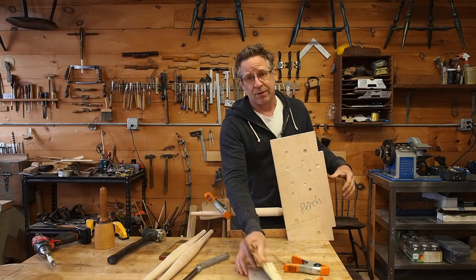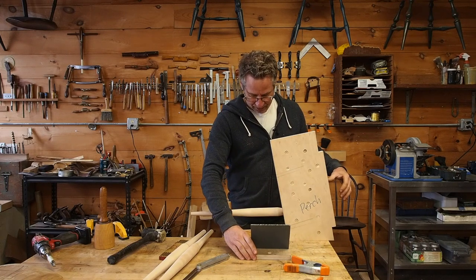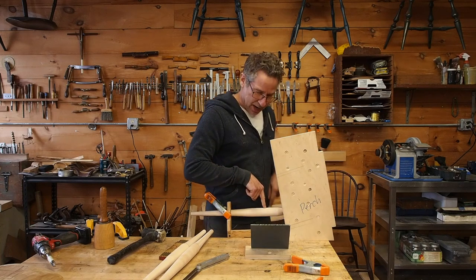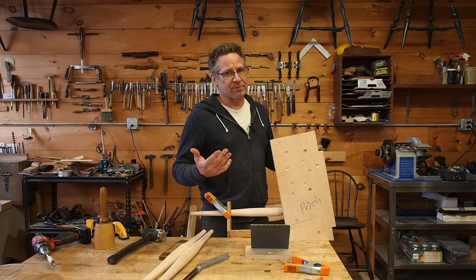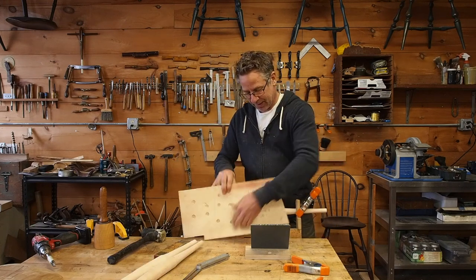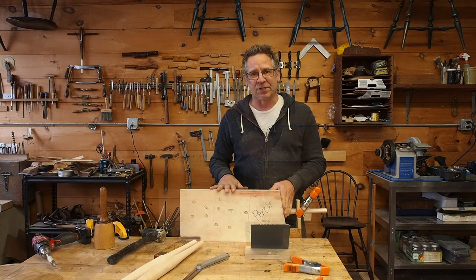What I'm going to do is take one of my mirrors and set it up right here. By having that mirror here, I can see as I'm drilling when I'm actually parallel to that edge — and that's my correct angle. They're the same, just different sides of the board, so it's a little less precarious and I like to do it this way.